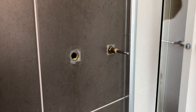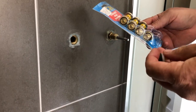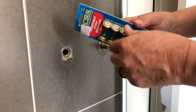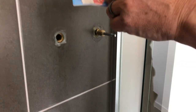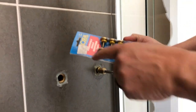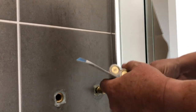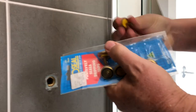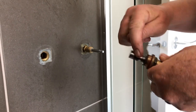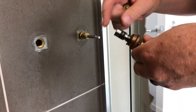I'm going to use a different style of washer - I've got tap washers with o-rings on them. They're just nice and gentle. I'll put a link to these in the description. Solid brass with an anti-hammer piece on the back and a washer there - they're really good. I've had these for probably 20 years, so don't go taking any notice of that price. We'll stick a couple of these washers in. If your tap has been tight at all, you can get a bit of silicone-based lubricant onto the o-rings and that'll really help it.